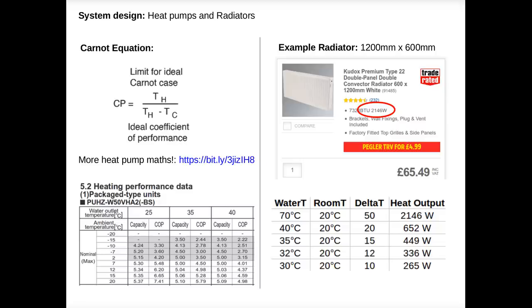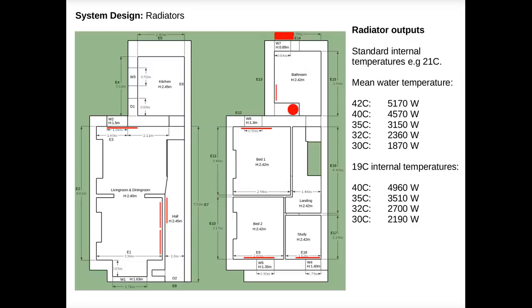Though it's not quite five to eight times more radiator area, as you also typically run the heat pump for longer in the day than you would a gas boiler. You can of course use underfloor heating, or fan-assisted radiators that provide a lot more heat output at low temperatures, though underfloor heating as a retrofit is a large job and fan-assisted radiators are a lot more expensive. Although I would have liked to design our radiator system to provide five kilowatts at a flow temperature of 30 degrees, I couldn't quite make that work without going for the more expensive fan-assisted radiators.